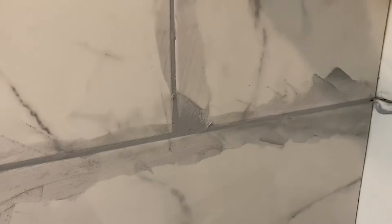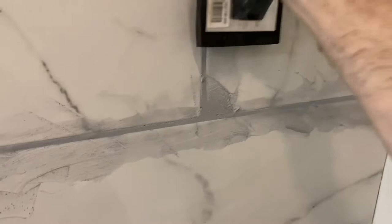This was a real pleasure to work with — it applies really easily. I always say that getting grout into the gaps is the easy, fun part of grouting. The harder part is the sponge work: getting it all smooth, filling any holes, making it look professional and finished, while also removing all that haze and excess. I'll show you how to do that shortly.